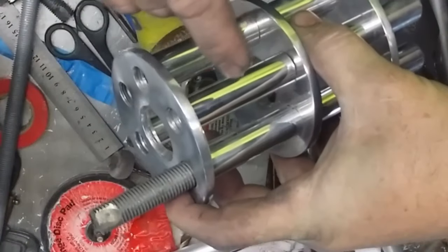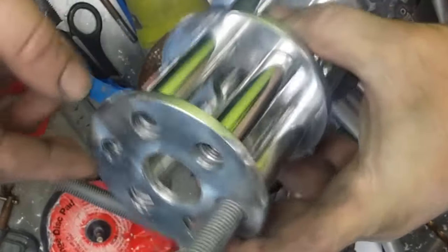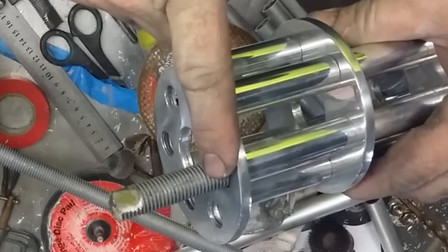For the last part in the forward series of barrels, I'm using a piece of thread bar that's just the right gauge to self-tap into the tube that's there. And I've made these holes a little bit smaller so that they tap through that hole as well. That will add a little bit of needed weight to the forward section of it. And threading that last rod on, rather than hammering it on, should make that final assembly a lot tighter as well.